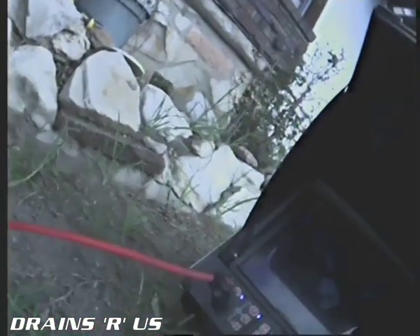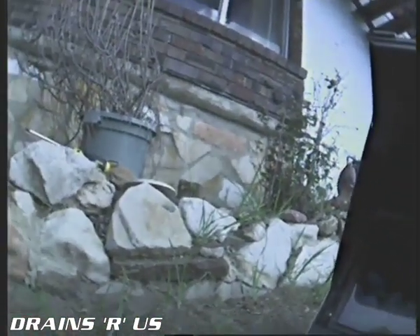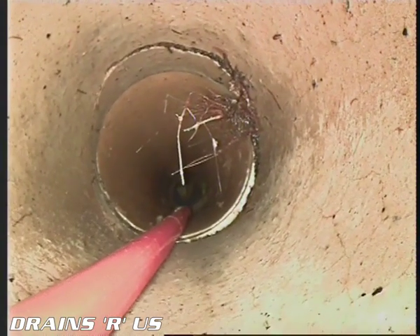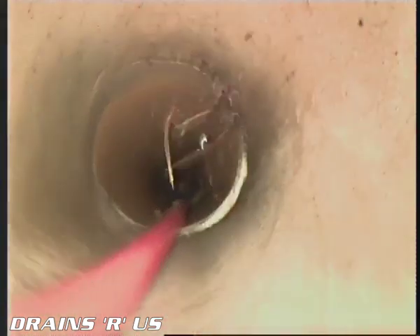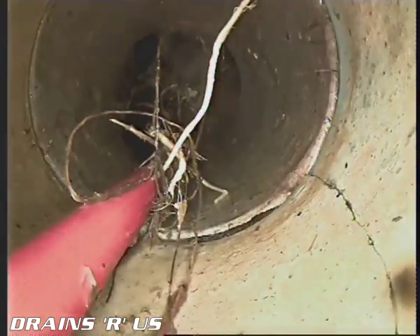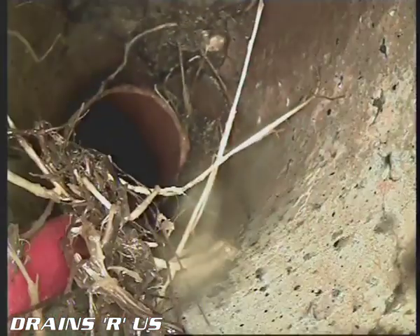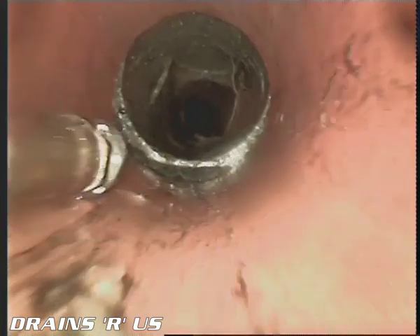This is the second video. I've just cleaned just up here from the shaft towards the house - it was blocked just there. But the rest of the line's got roots in it all the way to the back, and there's a bad blockage up the back, probably close to that pipe lining that I can't get the camera through. So there's my cleaning hose. Going back up towards the house - I've just cleared that big root mass that was stopping me getting up with the camera before. You can see the big crack in the pipe there, more roots, big crack in the bottom of the pipe, all the pipes busted through there, a bad misaligned joint, broken pipes with tree roots. That's the end of my jetter hose just there.